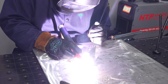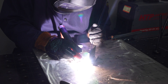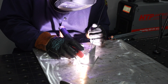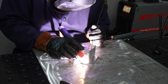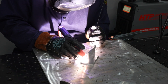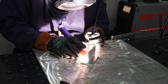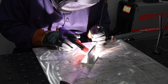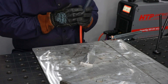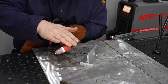I'll start up and it'll take a minute to puddle, but once I get my pool in there I can start feeding filler metal — and that is not long for ice-cold quarter inch thick aluminum. Running close to full pedal at 250 amps, it dabs in just fine. It's great to be able to run this thicker quarter inch without a whole lot of hassle. The weld came out really good.